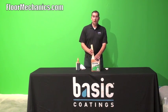A couple of key points with amberizer: never use amberizer on the first coat. Always use a sealer, or in this case, use emulsion as your first coat, followed by multiple coats of emulsion with amberizer.